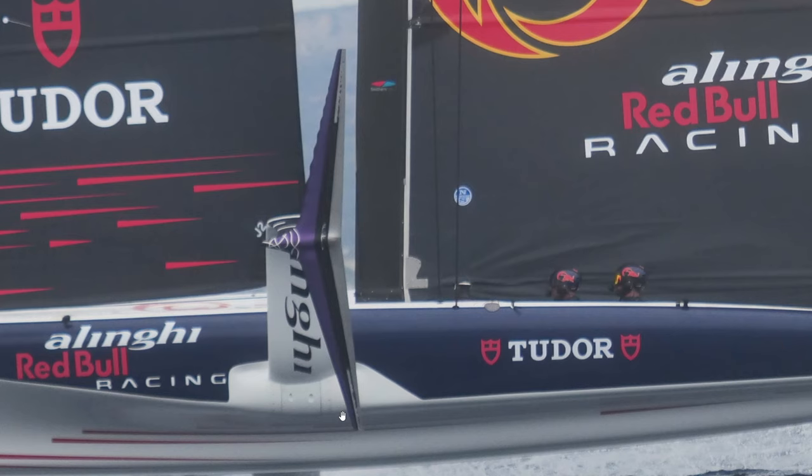And the final thing that has happened on this foil, and it's happened to a degree on other foils, but I think is significant, is that it's a pretty asymmetric foil. They've got the tubercles on one side and not on the other. And what we know is that the foils have to be symmetrical about the centre. But in reality, you'd probably want the outboard side doing a slightly different job to what you'd want the inboard side of the foil to do, and yet it has to be symmetrical in its construction.